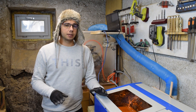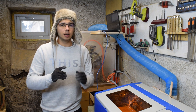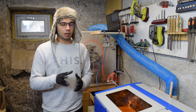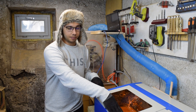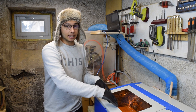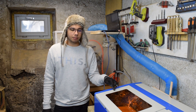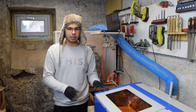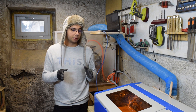Now to calibrate the mirrors. This is the most tedious part of the process but it only has to be done once, so take your time and try to be precise. There are three mirrors referenced as mirror 1, mirror 2, and mirror 3. Mirror 2 is on the Y axis and mirror 3 is on the X axis. The laser comes with a metal band plate for the second mirror mount, but if you have a 3D printer I would urge you to print my replacement for it — the files are down below. It's not necessary but it makes it a lot easier to adjust that mirror.